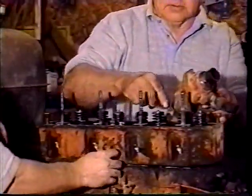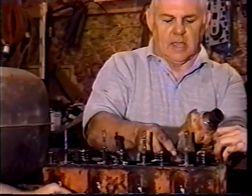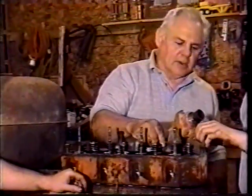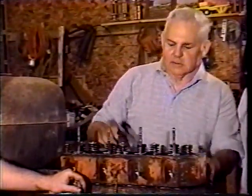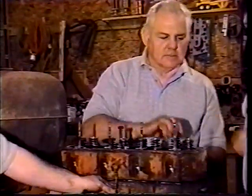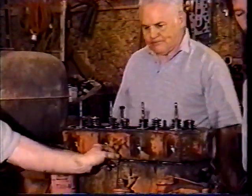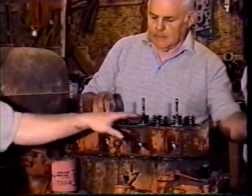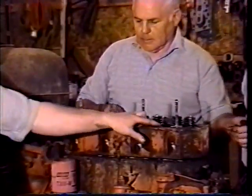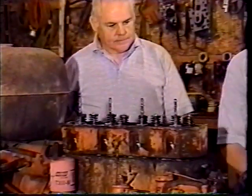This goes on with two nuts, and they're captured down under there, so you have to take them off with a wrench. But this little water manifold has to come off before the head will come off. The rest of the bolts out there. Also, on this side, there's an oil tube you want to make sure you get off, loosen that up. Get that out of the way. And then there's three smaller studs or bolts, nuts on this side that you need to take off. You can get this side out of those.